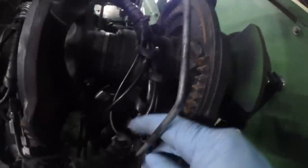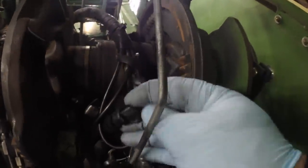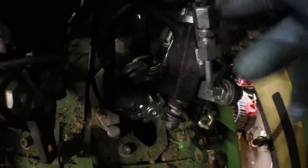Dealing with these grease lines can be a bit of a pain if your hands are bigger than normal people's hands. You have to get in and around, and put them in the right spot. If you don't have them in the right spot, you could end up with a problem because the needles come up through here quite easily. They will destroy some things that you don't want destroyed, like your grease lines. These are all on automatic grease, the grease system, so they have to be tight.